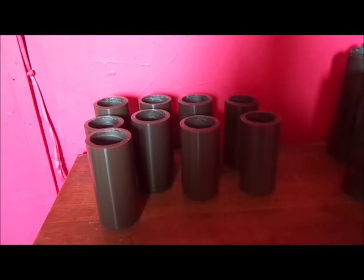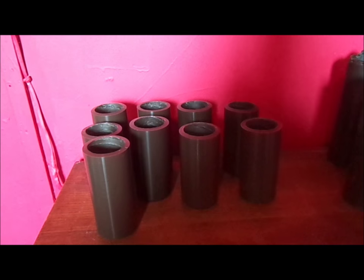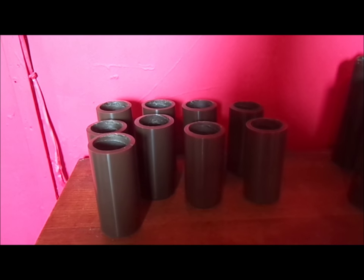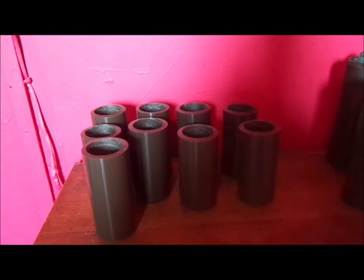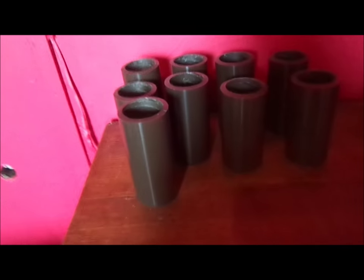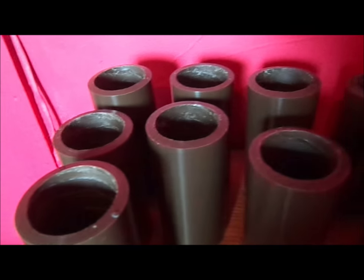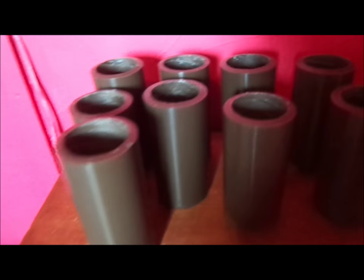Sometimes repetition will make the mold too hot, and the timing will be off, and thus you'll need to let the mold cool. There's a bunch of factors in molding and keeping bubbles out of the wax. Now, I showed you in high definition.